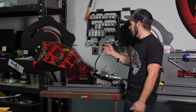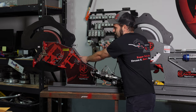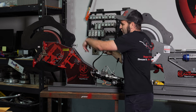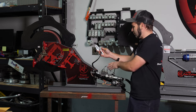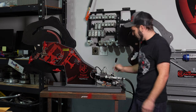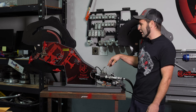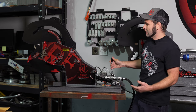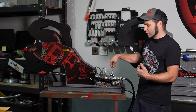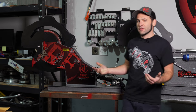I want to show you that feature quickly. This valve stopping switch is hooked up to the frame and it's adjustable — we call it the trigger — and it's adjustable around the bend wheels on brackets, which is what's actually going to stop it. While you're bending it comes to a stop via a 12-volt DC solenoid that shuts off hydraulic flow going into the cylinder. This one is a lot faster, and like all double-acting systems, it's lightning quick in reverse. We love that feature.